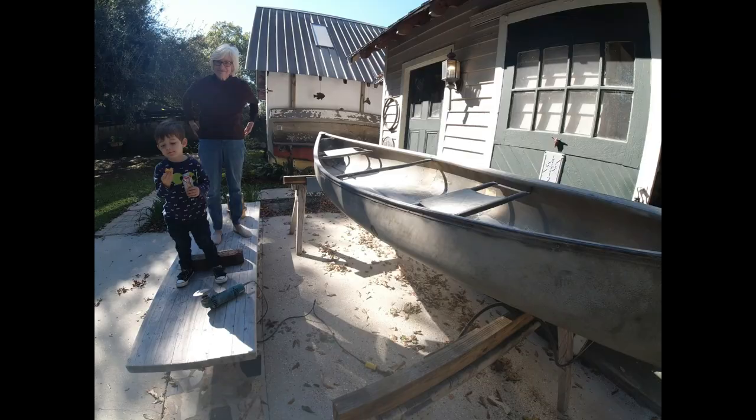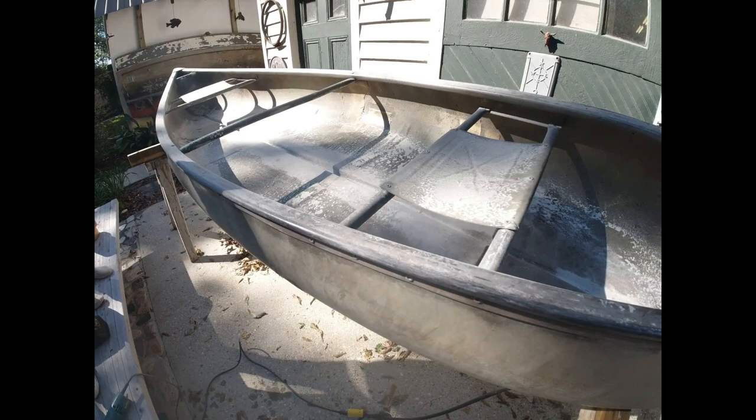I've got a lot of grinding to do — I have to grind these surfaces so the epoxy will stick. It's not pleasant. I've got my old purple shirt on, a dust mask, turn the fan on and have at it. There's no other way to do it. That was unpleasant, but I got all these little cross members ground down flat, got the trough ground so glue will stick, and got it sanded back three or four inches on each side.